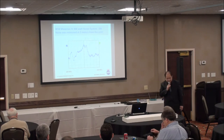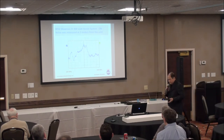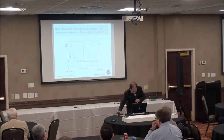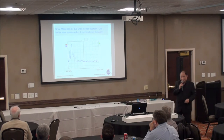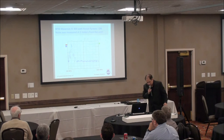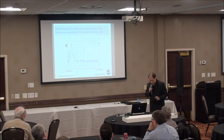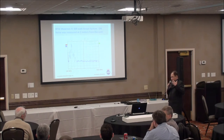If you want to use a BLE system with that surgical equipment, you simply measure up to that frequency. Luckily, the equipment doesn't generate much noise at 2.45 GHz. But the broader lesson is: if you're dealing with the 2.4 GHz ISM spectrum, you need to be very cautious. Unlike cell phones which get new models every six months, medical devices don't — so you must plan carefully and take everything into consideration.